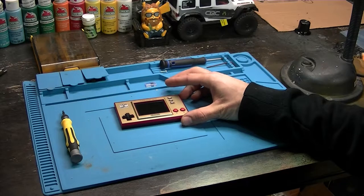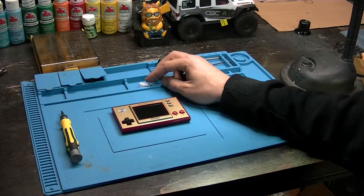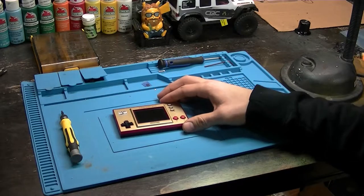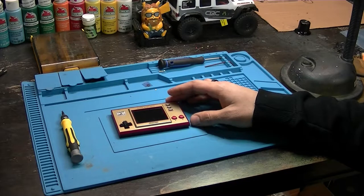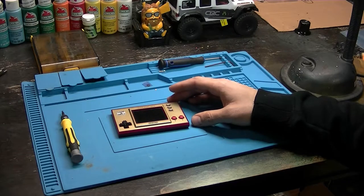In this video I'm going to show you guys how to upgrade the flash chip so you can play more games. On the original flash chip you can only play — I believe it's only a one megabyte flash chip on the original and it's only designed to hold that one Game & Watch game that it originally has on it. I believe you can only put probably a 127 kilobyte ROM on the original flash. If you guys have followed my video on how to hack the Nintendo Game & Watch you've probably already noticed this.